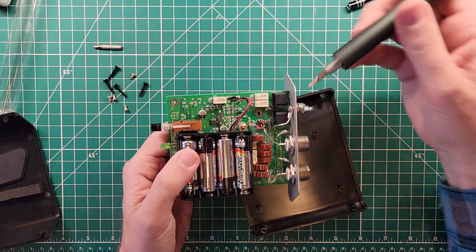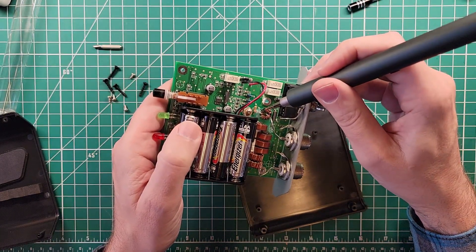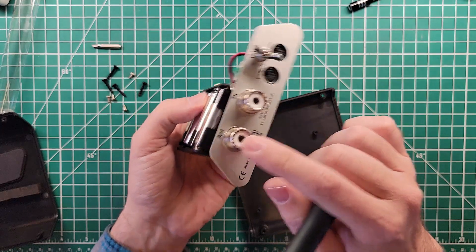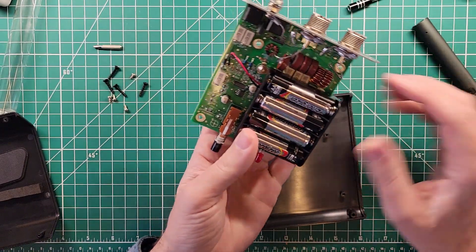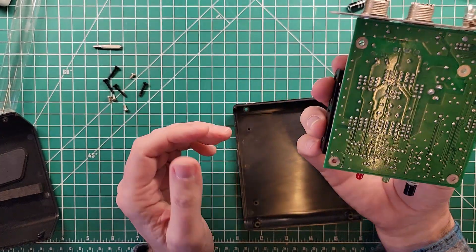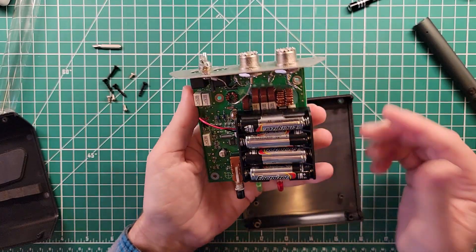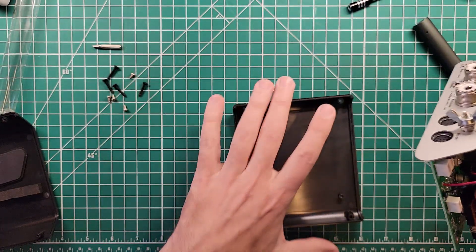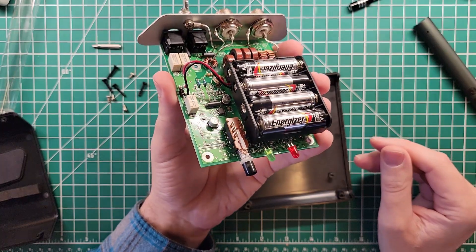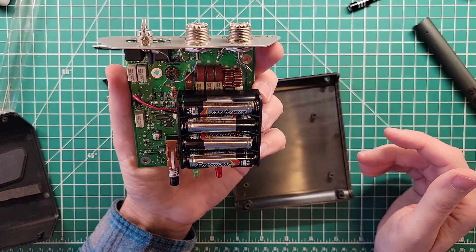Solid wires going through. This little thing right here is your SWR bridge. So from your transmitter, it runs through the toroid which measures the SWR, then through the switching network, and then back out to your antenna. This is probably called a Z817 because it is a Z-Match antenna tuner — but I'm just taking a guess by looking at this thing. It's a really neat little tuner. I like the fact that the case is made of plastic and is rounded because it's easier on the hands for portable work.